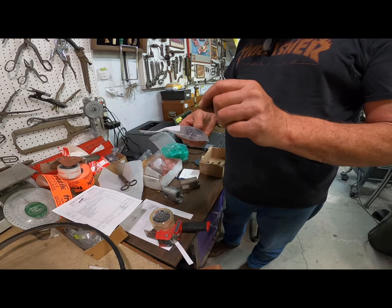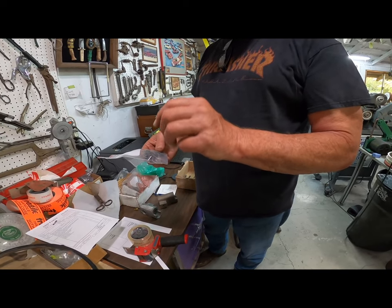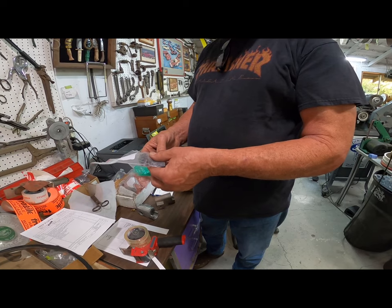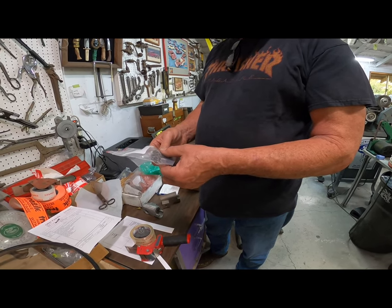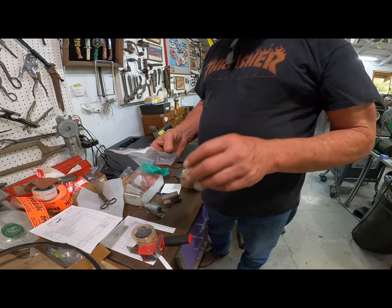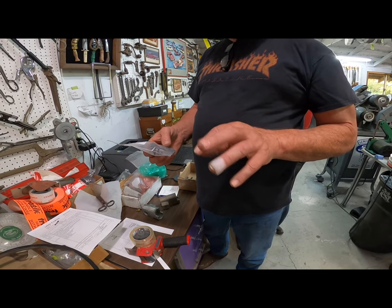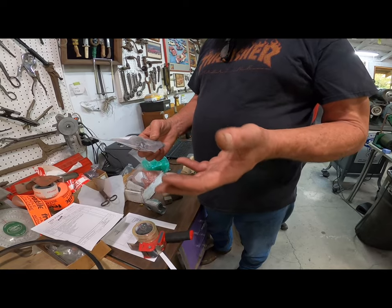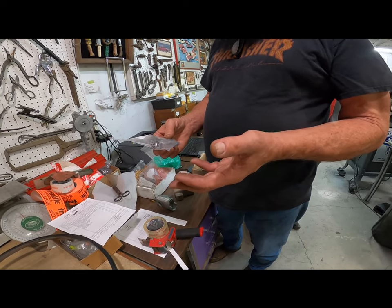They take a little dot of stainless steel, surround it in a resin, 3D print it, put it in an oven, and bake out all of the plastic so the metal fuses together. We send it out to have it done — it's the absolute most cutting-edge technology currently available.